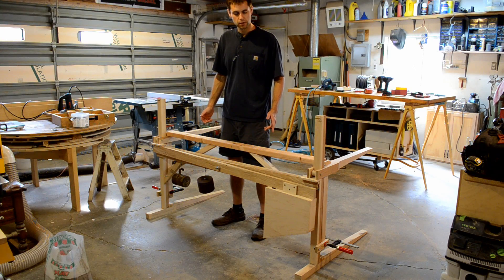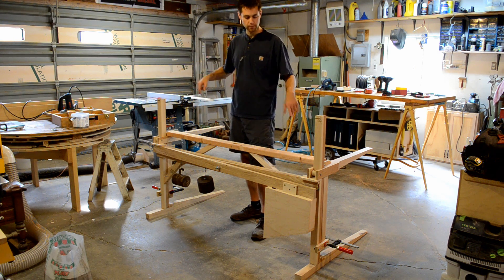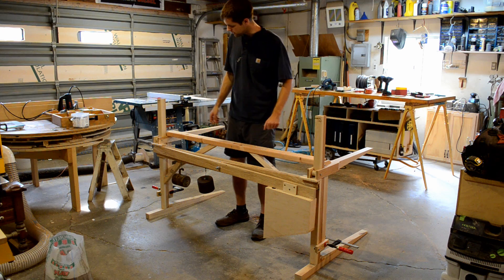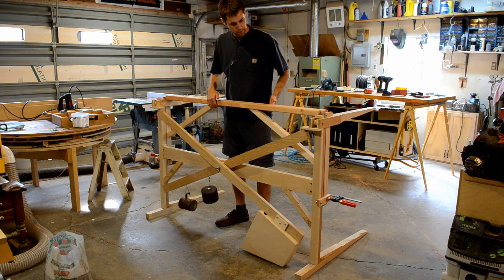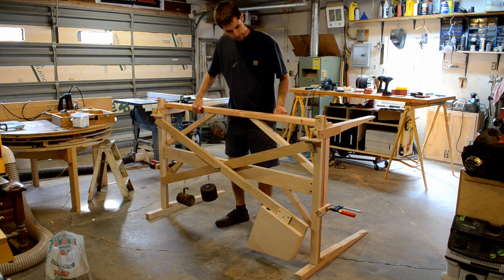This approach would also reduce the need for a damper, which I've realized is probably a project in its own right — so it may be better to hold off on that for now in the interest of keeping this one simple, and maybe have it as an add-on later. I also have other things I'd like to use a damper for, which helps make it its own project. Hopefully we can come up with a universal design. We managed to fix the smoothness issue by realizing that the arms were out of alignment with the legs, so we fixed that, and now things are running very smooth — it really just needs a touch.